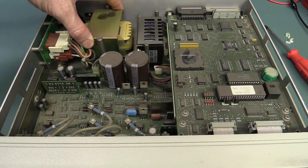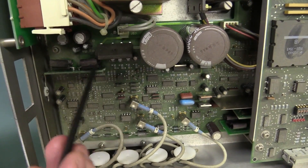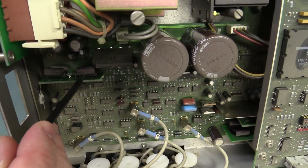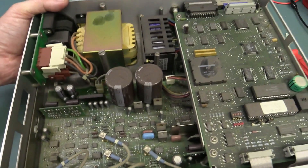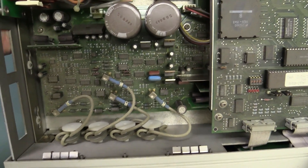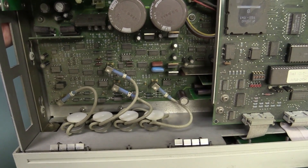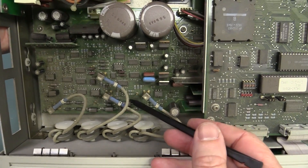We've got a big thumping linear transformer here. Interestingly, there's our diode bridge. We've got this little hybrid board with surface mount on the bottom and two probably linear regulators on top with little heat sinks on them. We've got a big bridge rectifier, and our two big filter caps — they're Nippon Chemicons, 105 degrees C rated, no worries whatsoever. There are our front panel terminals with little common mode toroids on them just to keep the crap out, and nice board-to-board connectors.